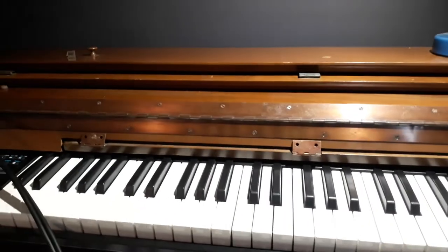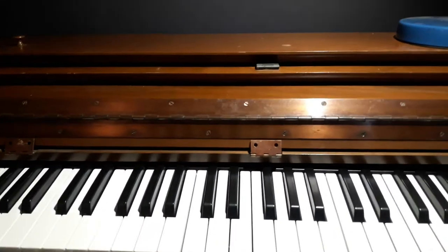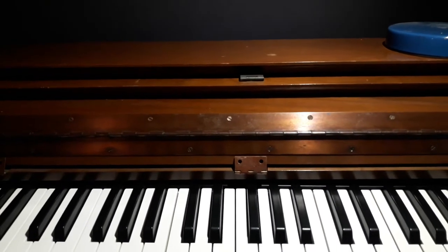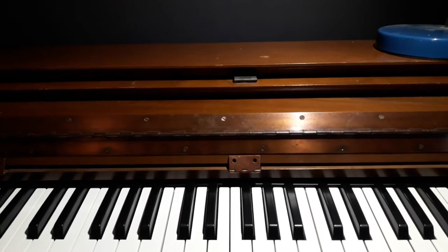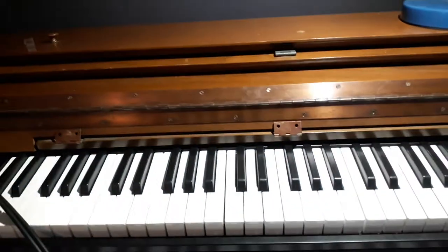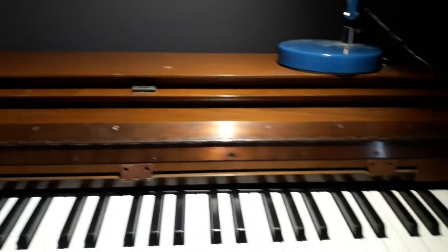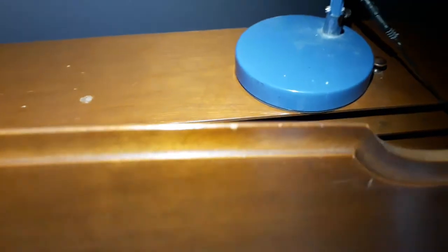So I decided to do some redesign and recycling, and I'm going to relocate the music desk up on top of the cover that closes up the whole instrument — which you can see as a triple-hinged arrangement and covers the whole instrument. I've recycled these metal brackets here and bent them to suit, screwed them on in a different location, and these brackets will slide in underneath the cover, which enables it to be removed in and out of position whenever it's required.